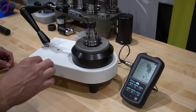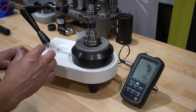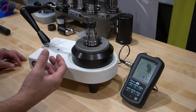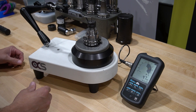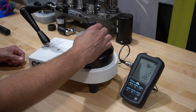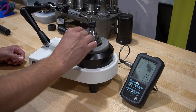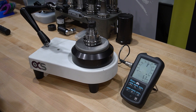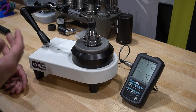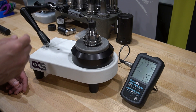Let's take this over and measure it. Back at our zero spindle with our over torqued ER16 — this is about 56 Newton meters, where we only require about 20 Newton meters. So it's not excessively over torqued, but it is over torqued for the size of collet. From the two microns we had, we're now pushing numbers up in the fives. We've definitely seen an increase in TIR just by over torquing. Let's go back to the table and discuss what else may happen.